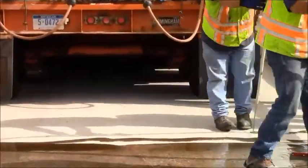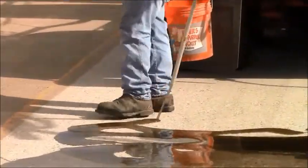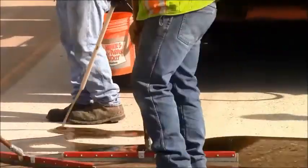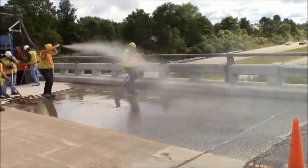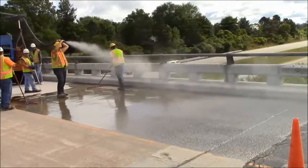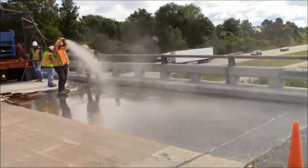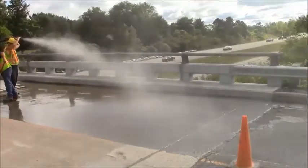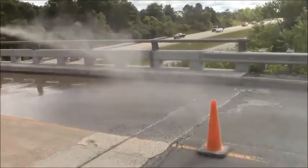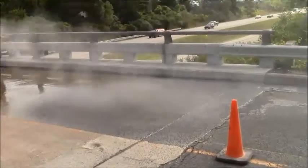This happens very quickly on a hot day. For this operation, the contractor has elected to use a pneumatic blower to broadcast the aggregate. It is important to cover the wet resin binder to refusal before it begins to cure and thicken in viscosity. The aggregate will fully embed into the resin binder at this time. Waiting too long can cause early loss of aggregate, especially within the wheel path, and a loss of friction in the wheel path can become a safety hazard.